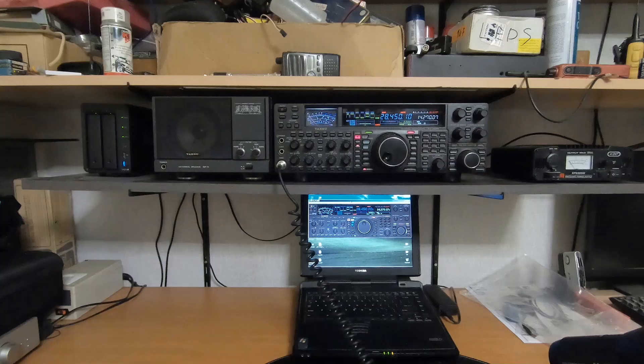So this is Papa Alpha One, Lima Echo Golf, now on upper sideband. We can see the ALC — I find it's around best peaking about 80 and the compression around 5, peaking as you can see. But very important to keep the compression down, I find, especially with this microphone, and the SWR is as perfect as normal. I can only think of a quick limerick to say, just to give the audio a bit more of a test report.